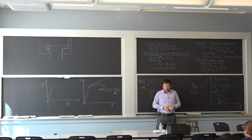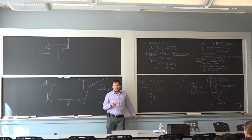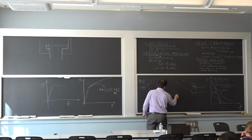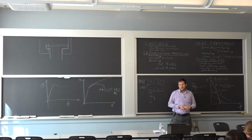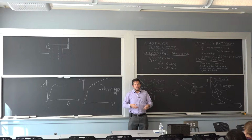So you have essentially equations that will agglomerate the effect of carbon, chromium, molybdenum, manganese. So when you know exactly what type of steel you have, you can determine whether or not it can be welded without becoming brittle. And that's the concept of the carbon equivalent. So what they did with the carbon equivalent for the SAE is they reduced it, so it's a little bit more of a pure material, and the pure material starts forming the equilibrium phases more quickly. So everything essentially that's added to the steel, especially the chrome, is a barrier for the diffusion and the transformation into the pearlite, this lamellar structure that we've talked about.